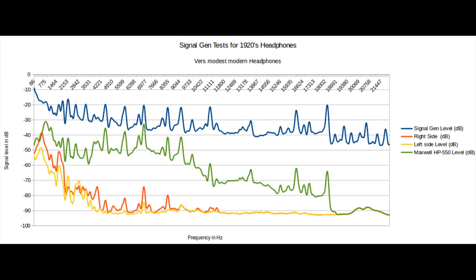Basically, as you'd expect, it's a steel plate in these 1920s headsets, so the higher frequency stuff is going to be gone, maybe some other ranges too, and then you'll have odd artifacts where this steel plate, because there's no dampening involved, will resonate in a strange way, and so you'll have little artifacts that show up that weren't in the original music. And of course, if you look at the raw MP3 file, there's no transducer strangeness going on and nothing absorbed. It's just the raw file without any theoretical loss to be concerned about.